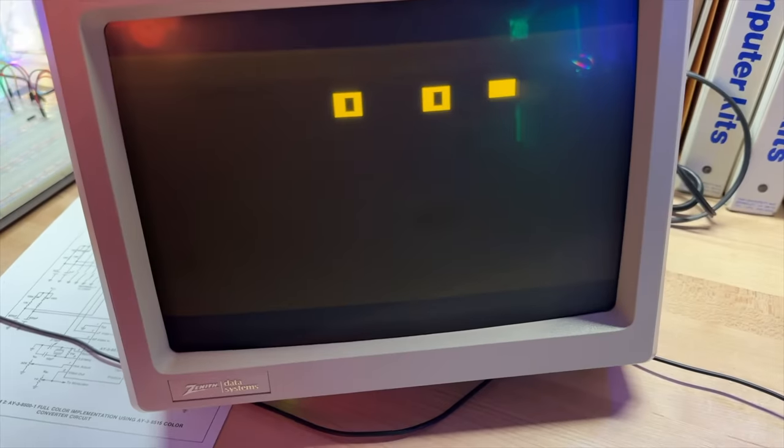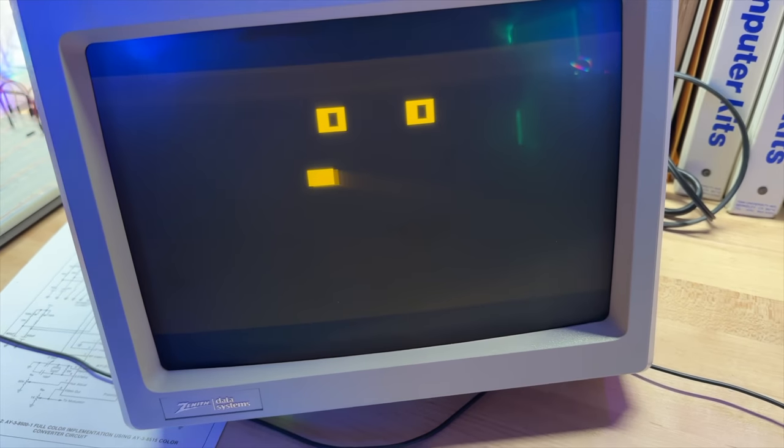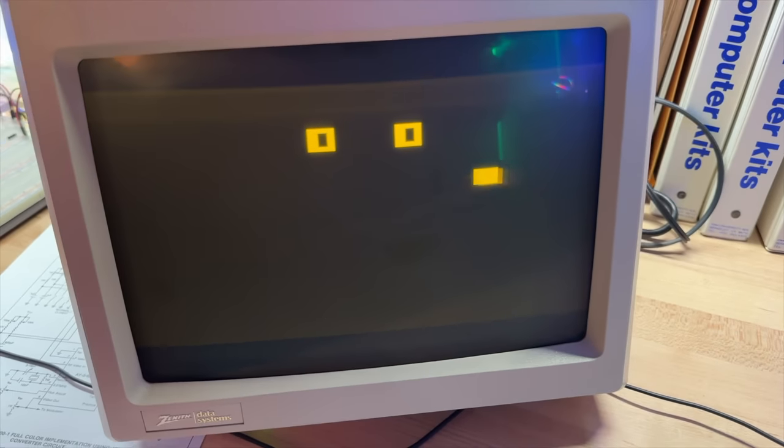There are two shooting games that we can enable on the chip. A dot either flies across or bounces around the screen. My guess is that you use a light pen style, light-sensing rifle to shoot at the target, and if the pulse you see from the gun comes back during the draw from the bullet, then you know that a hit was made. I'm not sure if this game was ever exposed on any games here in America, though it looks like it might have been used in Europe on the Philips telegame under skeet shooting. My next step, if there is one on this project, is to build a proper PCB and retrofit it into an original Telstar case. I've had ideas about HDMI output and USB-C input power, so let me know in the comments if there's any interest in me updating and retrofitting a Pong console.